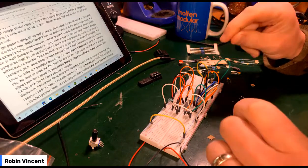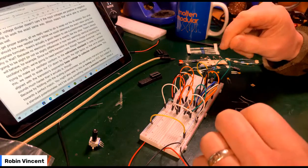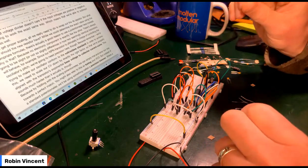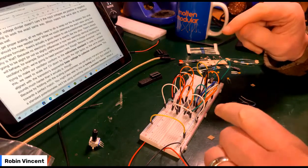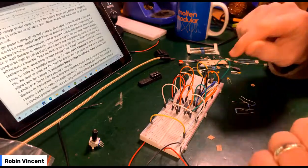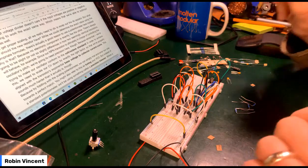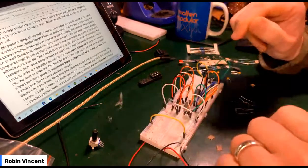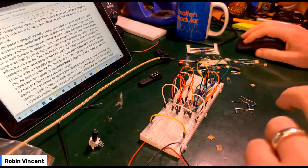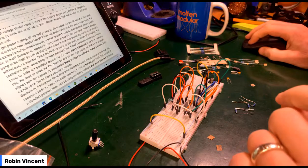And we're trying to make our oscillator conform to the volt per octave standard. So in order to achieve this, we need to scale our CV down by exactly the right factor so that we're properly aligned with the transistor's exponential base voltage to collector current curve. Sounds much harder than it actually is. No, I mean, actually, that makes sense. It makes sense to me. By fiddling with a scaling potentiometer, we can simply trial and error our way towards a perfect match.